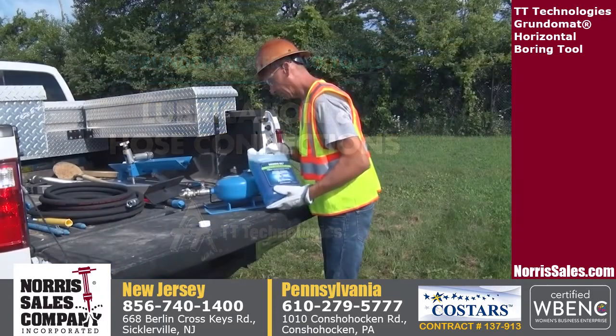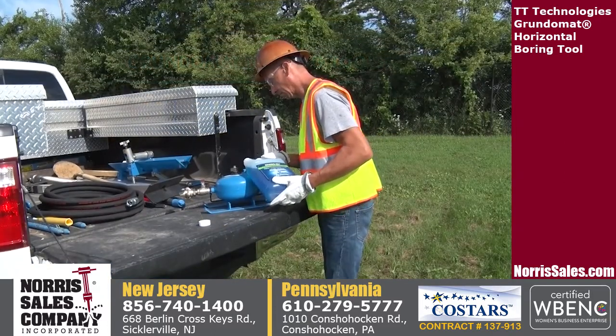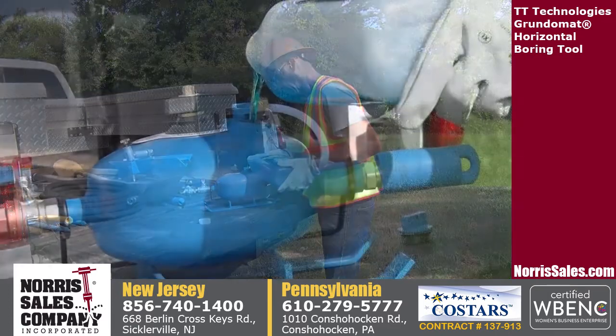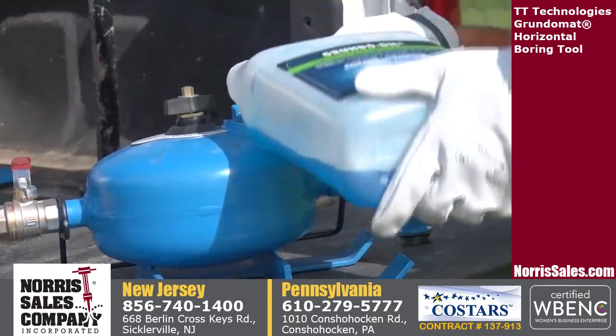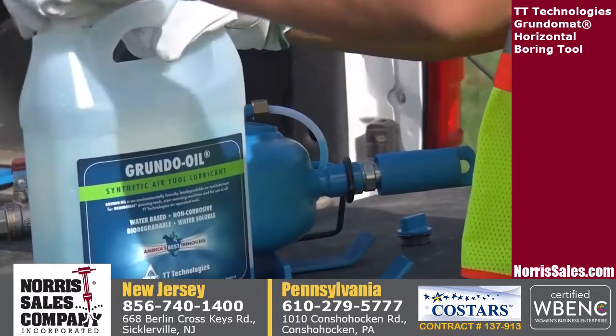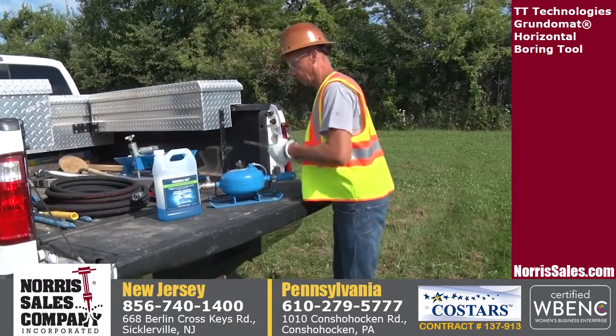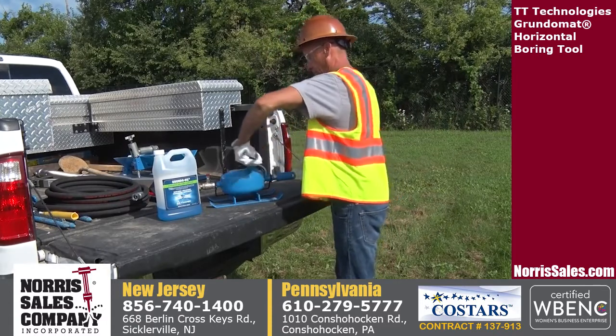Fill the lubricator with Grundo oil. Grundo oil is a high-quality pneumatic lubricant, essential for optimum piercing tool performance, and supplied to the tool through the inline lubricator. Grundo oil prevents water vapor from freezing inside the tool and is completely safe, biodegradable, and has no harmful effect on rubber hoses.